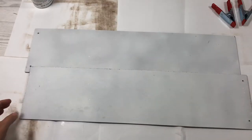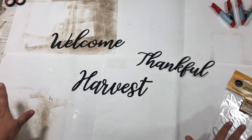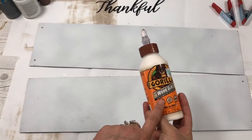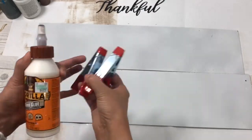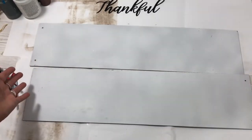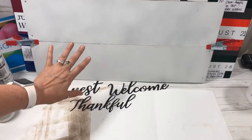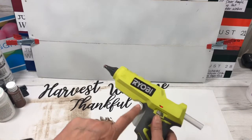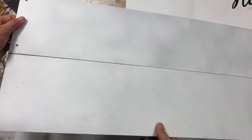Since you have two pieces, you're going to have to glue them together. I used wood glue. Then you're going to want these metal pieces from the Dollar Tree for your sign — I used all three and I spray painted them chalkboard black. I used wood glue to glue the panels together, put it all along that edge, then put a clamp to hold it. You can buy these little clamps at the Dollar Tree. Let that dry — it'll set in a couple hours but won't be really strong until it's been set for 24 hours.